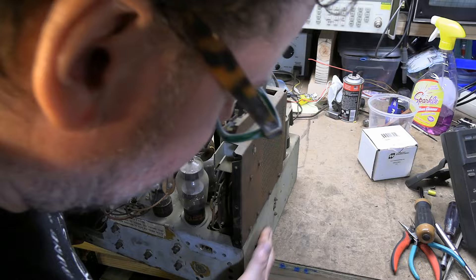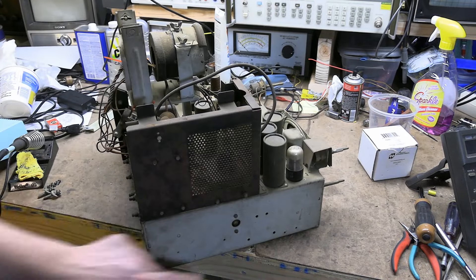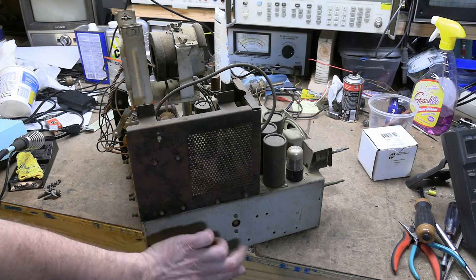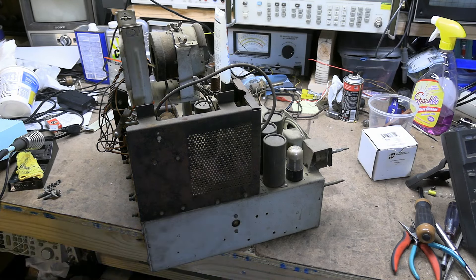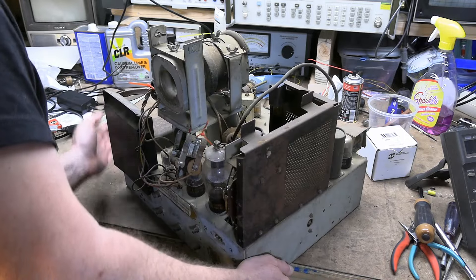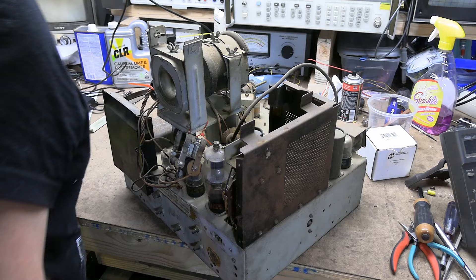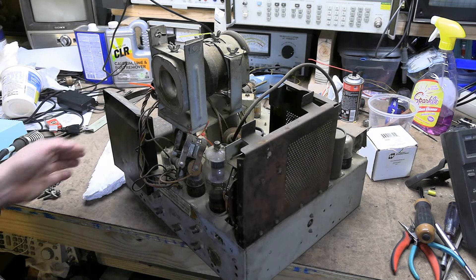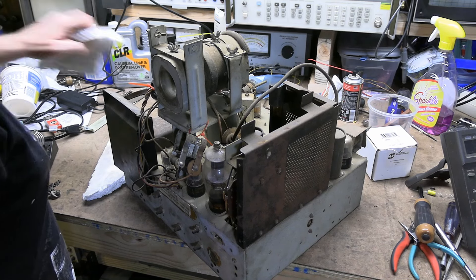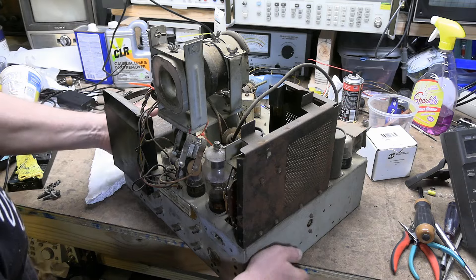I see some of these models tip on this side. That's the horizontal oscillator coil, and there are a couple of bolts sticking out, so you really don't want to tip it on that side unless you put some padding in there. The other side is the antenna input. What I got into the habit of doing is using some scraps of styrofoam — when I lean the chassis over, I throw those under it to keep pressure off the wire and fasteners.